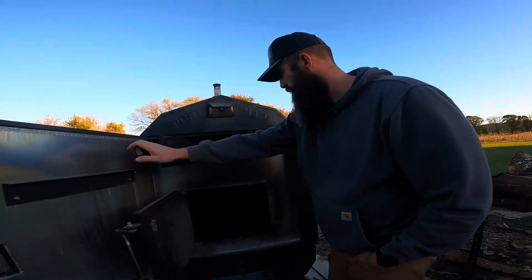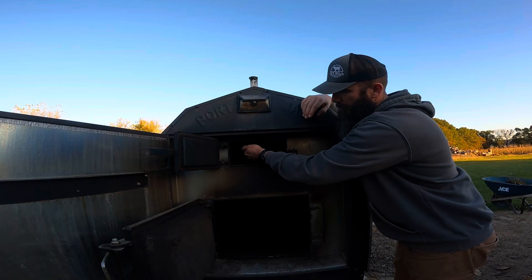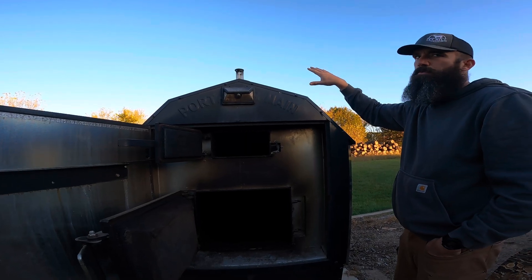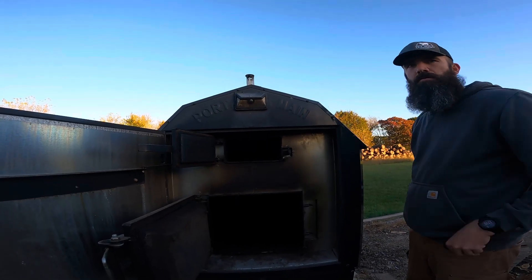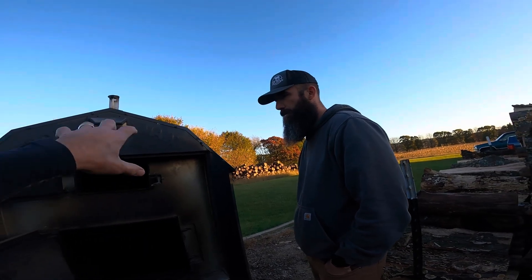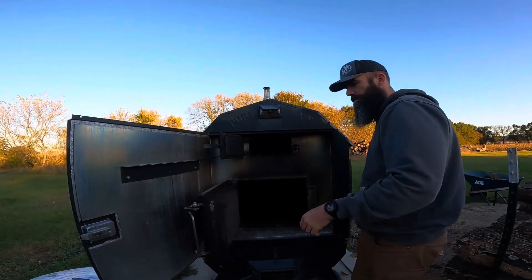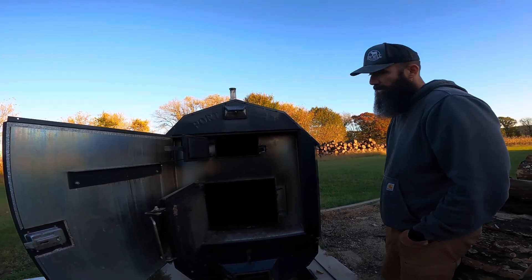The other nice feature is the two-pass design. The chimney comes up there, brings all the heat and smoke forward, and you still have water sitting on top and then it goes back. If you're running really clean dry wood, sometimes you have to look for heat waves coming out of the stack - you won't even see blue smoke, it's just burning clean and efficient. When the fan first kicks on you'll get a little smoke, but within about two minutes it clears right up.